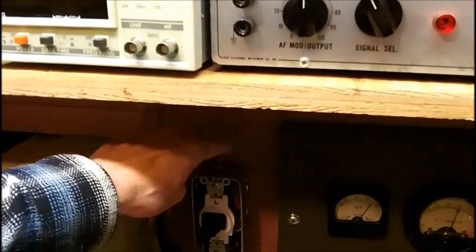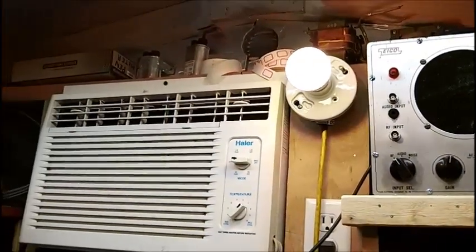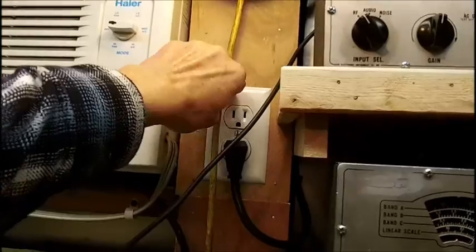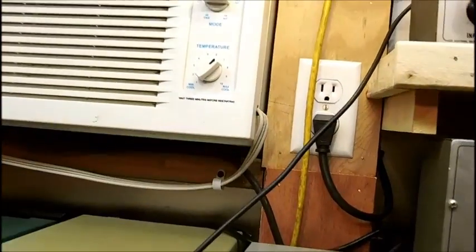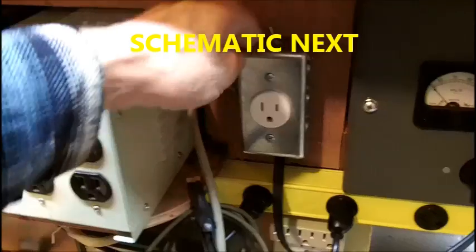Anyways, I might have a 100-watt but they're crappy bulbs — you just tap them and they burn out. The filaments just fall apart in them. Cheap junk now. All right, so if I turn this switch here to take the shunt off of the bulb — now the heat is off. And this is what would happen if you had a radio or TV or whatever that had a short in it or a heavy current draw. I'm not going to use this bulb, I'm just doing this as a test. I just got to put some little wire clamps in here. I left myself pretty slim here but I'm right up against there. So that concludes the dim bulb section of this video — that is my dim bulb arrangement. That's all she wrote.